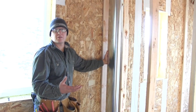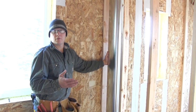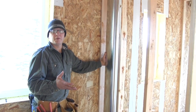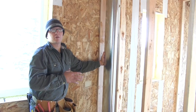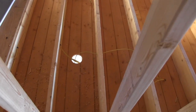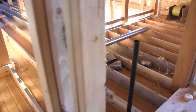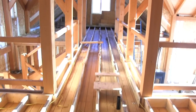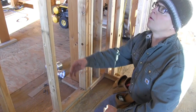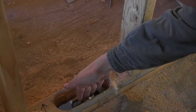With this being a timber frame house, utilities become a little more complex — it's not like a stick-frame house where you can just bury everything in the walls and subfloor. You have to think about how you're going to put things in. With the HRV there was a little more thought on how things had to be run. We had to leave the upstairs floor open without subfloor so we could run all our utilities first — in a normal house build you'd sheet right over and run utilities from below. To install the HRV you had to know where all the wall ducts and the supply and returns had to go inside the rooms, with the wall duct going down through a 2x4 wall.